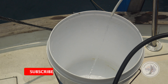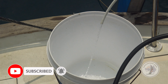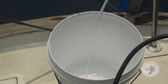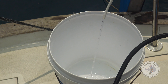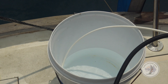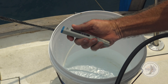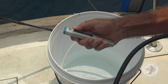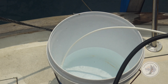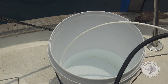We're right in the middle of the operating green zone and there's water coming out from our product line. I like to run it straight into a 20-litre bucket first — we'll need flush water later anyway, so that runs everything through and it's nice and clear. With our water tester, it's showing around 200 parts per million. Drinking water needs to be 500 to 800 PPM, so this is well under — more pure than what you'd get out of your tap at home.